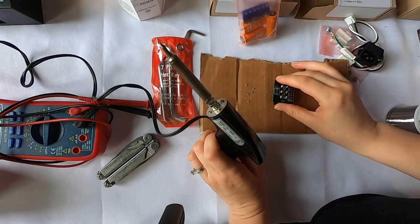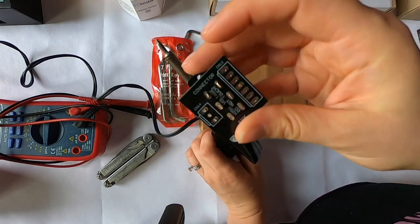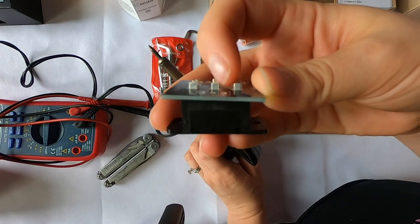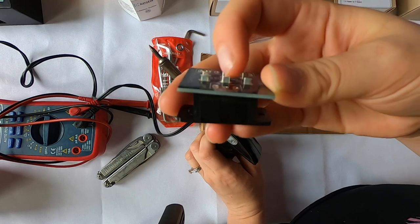So what I've done so far, I've lined the switch up properly here to each of the points where it's supposed to go in here. And then I've trimmed this, and that's to help avoid interference. And also when you're soldering, if you have less surface area, then it's faster to heat up the element so that you can get the solder onto it.